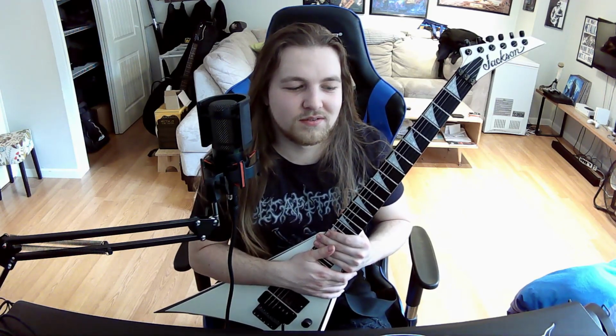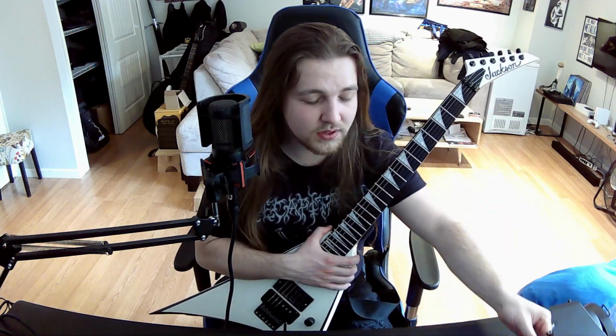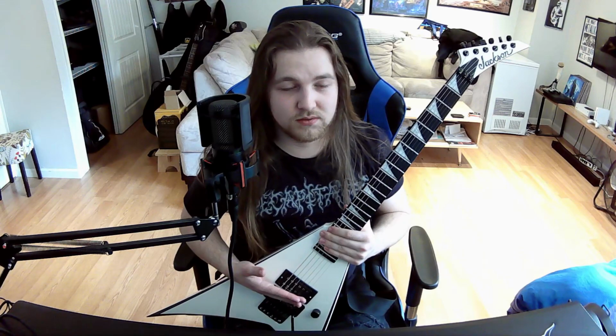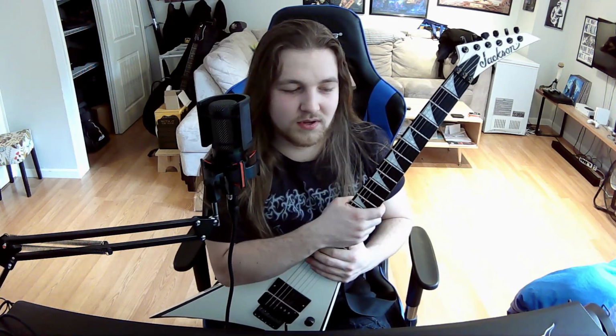So if you've got an extreme metal shaped guitar and you're planning on switching to EMGs, make sure you buy those wires individually. The battery cable and the output cable. I can link those in the description below. And also be aware that there might be some soldering if your holes are not big enough to allow the wire to pass through. So just consider that. If you have an extreme metal shaped guitar and you want to go back to EMGs, you might have to solder a little bit, defeating the whole point of solderless.